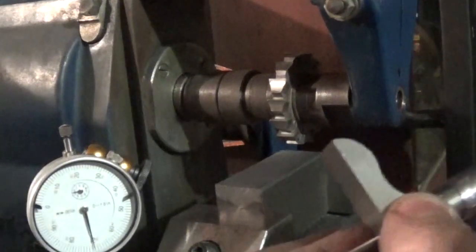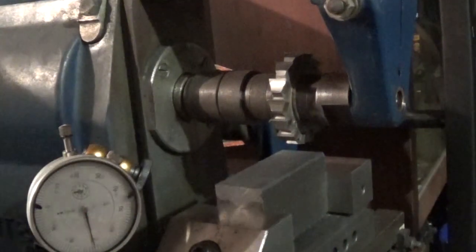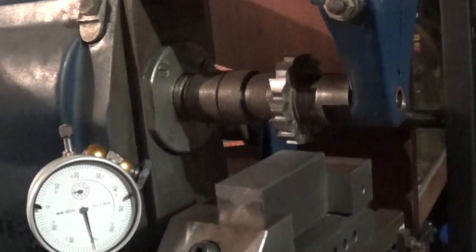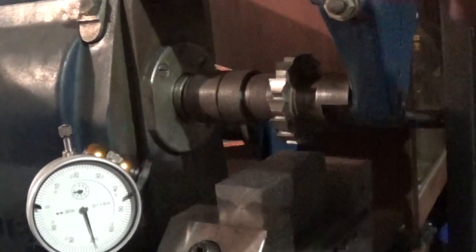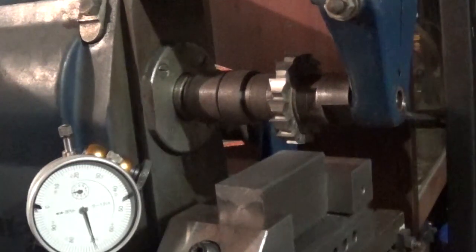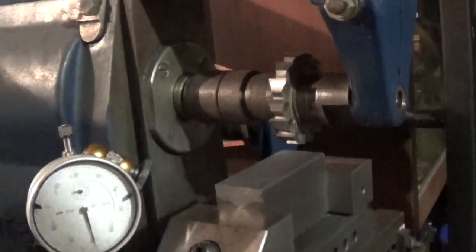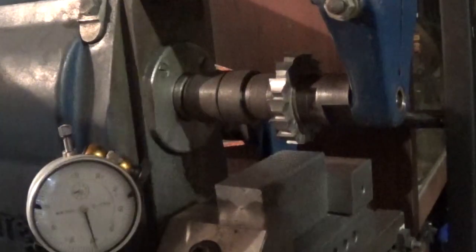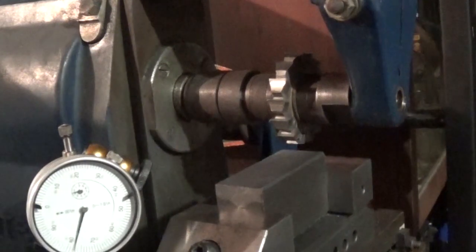And I believe that's about 32 thou over 1 and 3/4 inch. So 31 thou we really want to take off. But say 30 thou would be nice. That gives us a couple of thou just to clean up. I've got this set up here. Because we don't have any actual calibration or measurement on the Z-axis on this. So if we loosen that off, I think we need to go about 30 thou. That's 10.